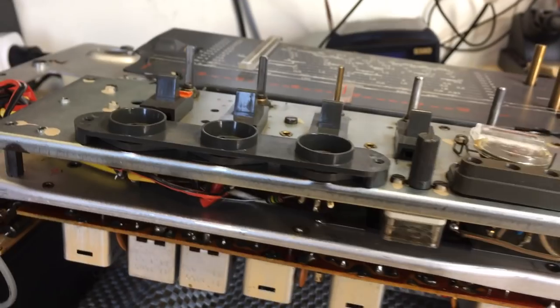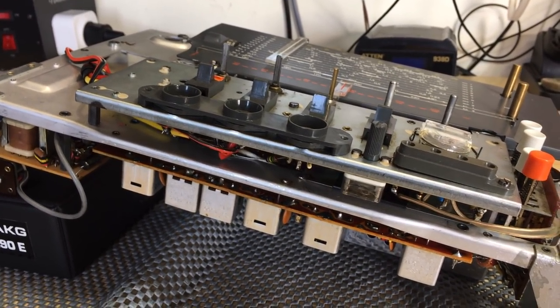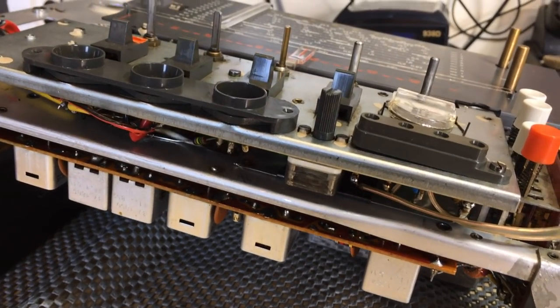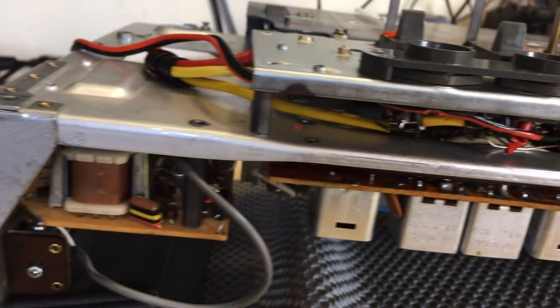And this thing really deserves it. So I'm not going to actually flip this yet, because one thing you've got to be aware of is every time you open one of these, if you're not careful, you do more damage than you do repair. So you go in to fix something. If you're not careful as to how you actually take this out, you start doing stupid things like having resistors touch the chassis and short-circuiting there, and that causes another problem later on.